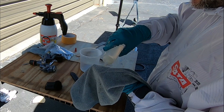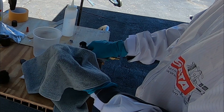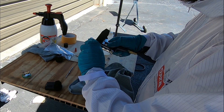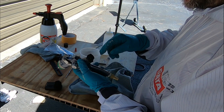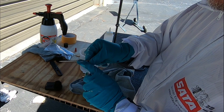For the air cap, you should just have to wipe it off - put a little bit on your rag. You can see it's clean, it just has a little overspray on it. One other thing to remember - I don't have the grease out here with me - you want to put a little bit of grease on the threads for the air cap, a little bit of grease on the nozzle itself, and then on the needle, put a little bit of grease here and here.